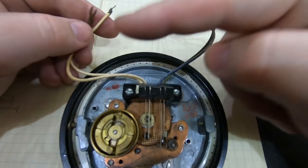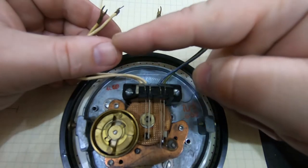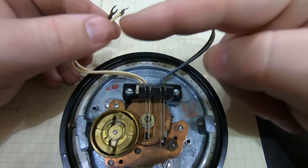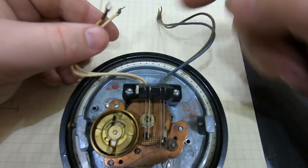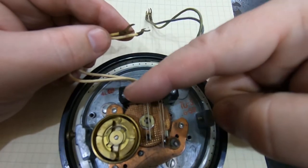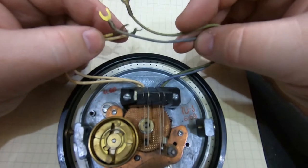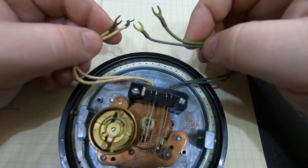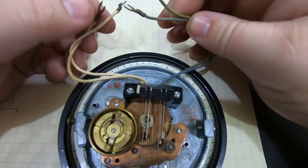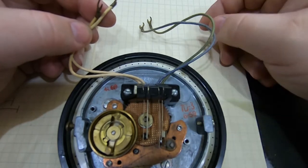But the 5 volts will be coming from an input I'm going to call the party line, and that'll be normaled into there. So if nothing's plugged in, then you see the 5 volts. But if something is plugged in there, you'll see whatever's plugged in there. So that could be an audio signal, for instance, which will only be coming all the way through on this line when it's dialing, and will only be coming through in pulses as it dials through this line. I think that could be kind of fun. We'll have to find out. But first of all, it's the easiest thing to do, but also it just seems faithful to this mechanism. And it's a cool mechanism.